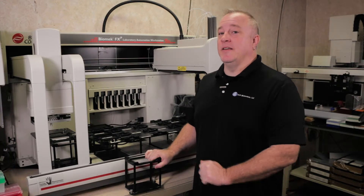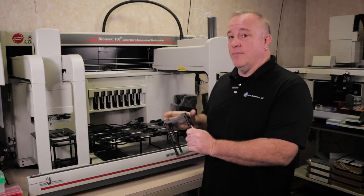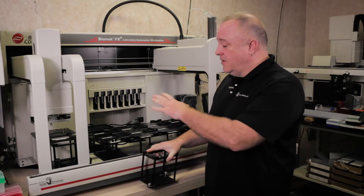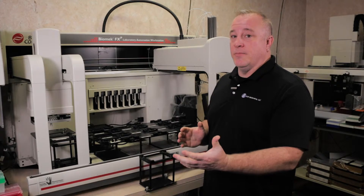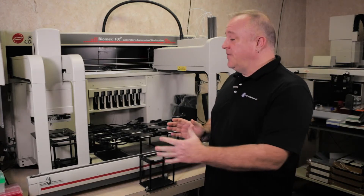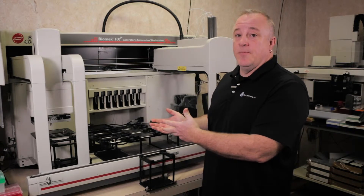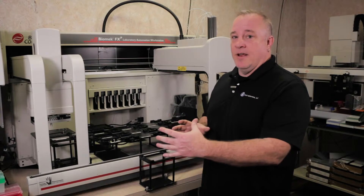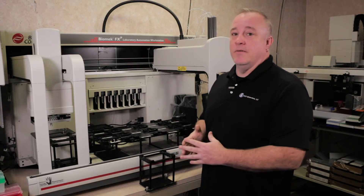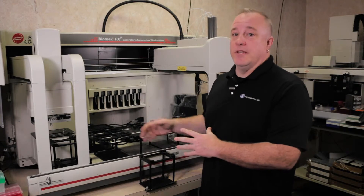So there are a few reasons why you want to teach the deck. One is if you're adding a brand new ALP to the deck — say you have a one-by-one position you want to add — you would need to put that on and teach it so the software and the hardware sync up in the positions. Another reason is if you find that one of your positions is off a little bit; for example, if you have the tip loader and it's not loading tips so well, you want to reteach it and get it lined back up so the tips are on correctly. Or if any of the other positions are off, you want to reteach those.